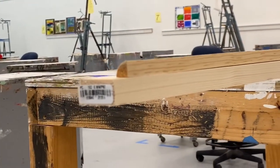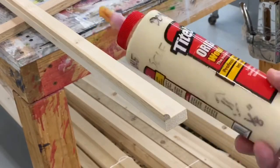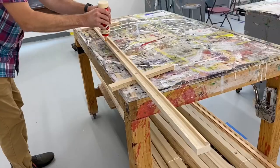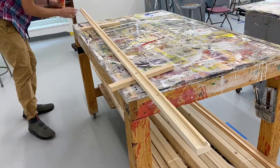I'll give you a sense of that. The planks in the classroom are six feet long, and you'll get a six-foot long piece to make your stretcher. We're going to use some wood glue to attach the quarter round piece to the plank — put a good amount, but not too much, because it's going to squeeze out.